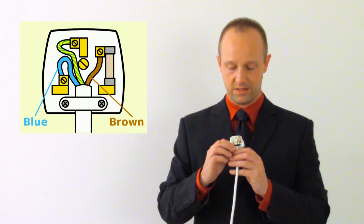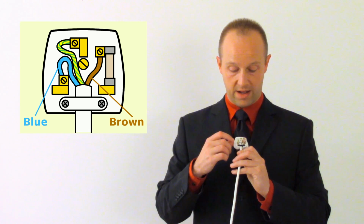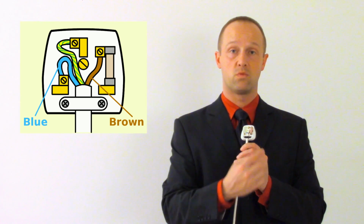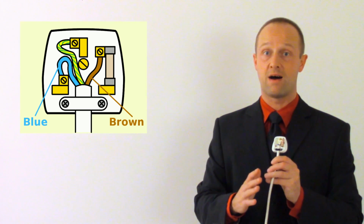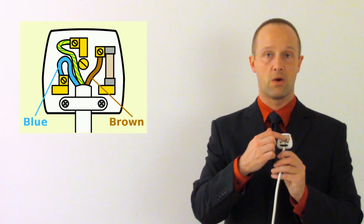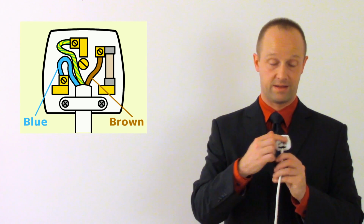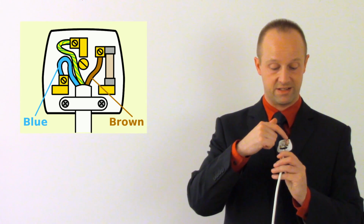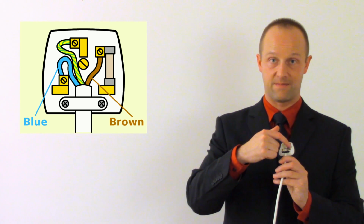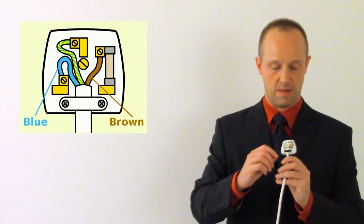So to run you through this, we have a wire for each one of the different pins. The brown wire, the live wire, is connected to, when we're looking at it from above, the bottom right pin. So that is BR for brown and BR for bottom right pin. Actually, in practice, it might sometimes go up a little bit towards the fuse, but it is always going to the right pin. And that pin is always going to be at the bottom right. It's just that it's got to connect via this fuse here. And the only way to fit that fuse in is often having it raised up a little bit there. But BR, brown, BR, bottom right. That's the key thing to remember.